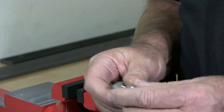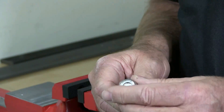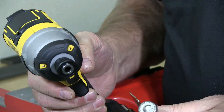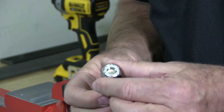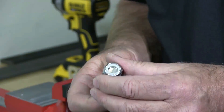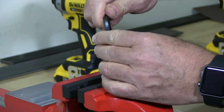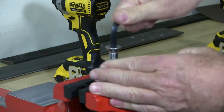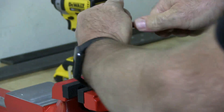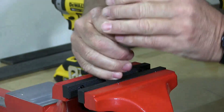I'm going to try and get this nylon lock nut to go up on this flat socket head screw. This nylon lock nut has a nylon insert. It's not recommended that you use an impact wrench or a drill to put these on, because the more friction you create will cause more galling, more heat, and you'll have immediate stoppage. I'll do this a little fast to see if it creates enough heat for it to seize up on me — which it's starting to right now. As you keep turning, it's going to get tighter and tighter, and that's galling happening right here.